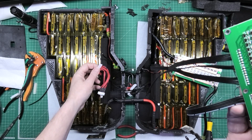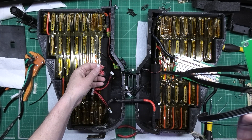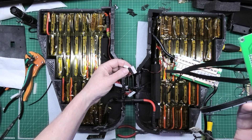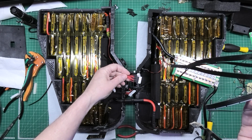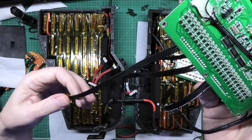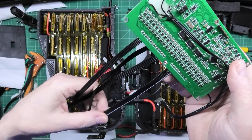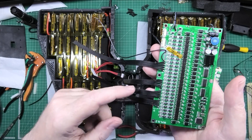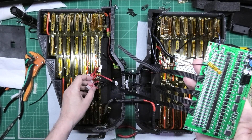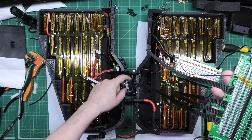The first lot I've got to solder to that, and then I've got to put another lead, another connector on there so it goes over the other side, and then I can cut those and solder those directly to these. I'll make some new plugs up and put them so they'll go over to these here. I know these are only about 26 AWG which is plenty - it's only 200mA. They don't even get warm at full load. The first 10 or 11 of these have got to go over to the left hand side.